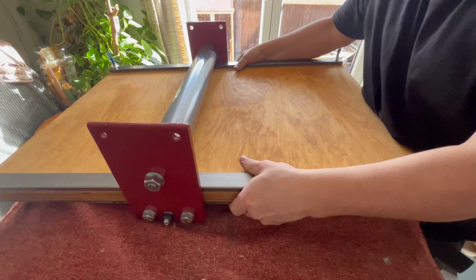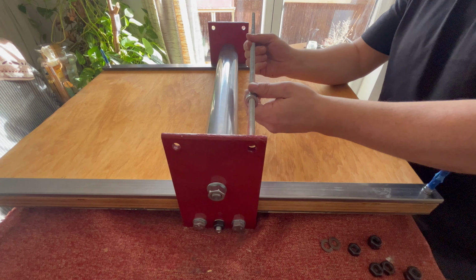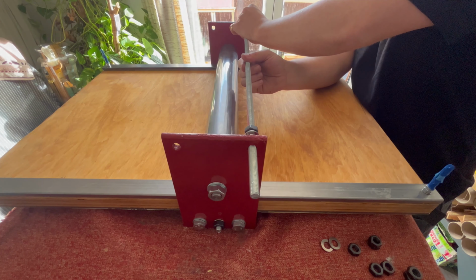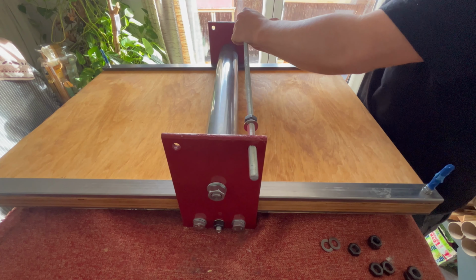At the top of the press, the roller is installed with spacers and nuts. The height between roller and pressing table is fixed by the height of the top steel bars, 5 centimeters. The roller rods are sturdy M18, ensuring it can bear the pressure. Additional threaded rods are installed.